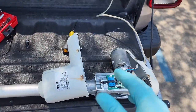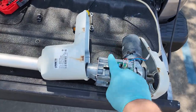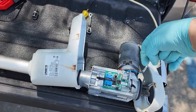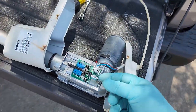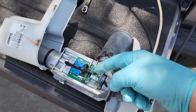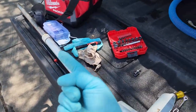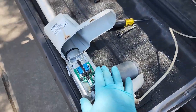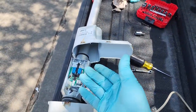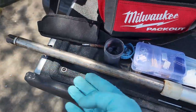If a linear actuator goes in one direction and not the other, there are limit switches inside — that's true of all linear actuators. Basically you have a motor that has a crown gear or a helical gear, and that actuates on a screw which drives it in and out. There's a lot of mechanical advantage because it's a gear driving a screw. They are prone to wear and tear, and as we can see here, this one is just getting old.